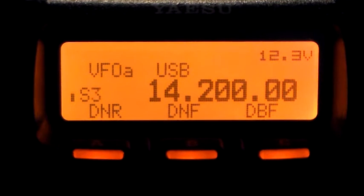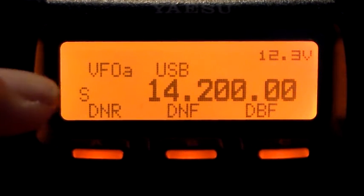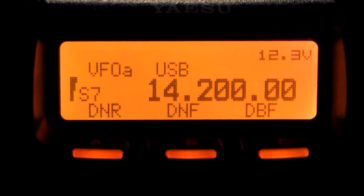So as far as radiating noise goes, that's probably not bad for a budget variable voltage switch mode power supply at that distance from the radio — that's not bad at all. On 14.2 the AGC's taking a bit of time to settle down — we've got no noise at all. Let's turn the power supply on. It's putting about S7 of noise on 20m.